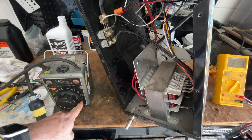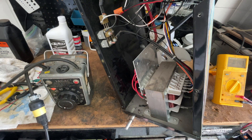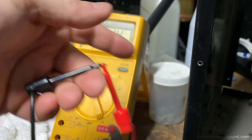I would never go full tilt here knowing there's a problem — it would put way too much strain on the system and my test equipment. You'll also notice that even at reduced voltage, the fan doesn't move at all. So we're going to kick off a power-off troubleshooting starting right at the plug, which means it can't be plugged in.